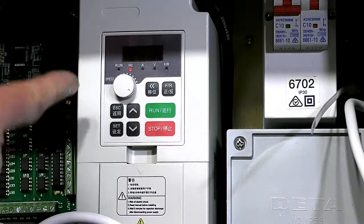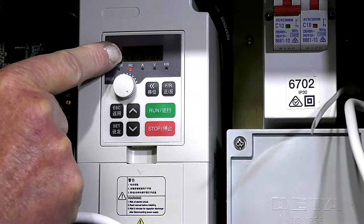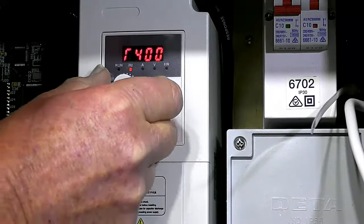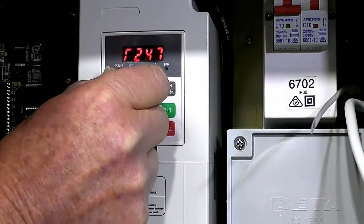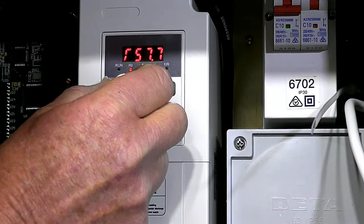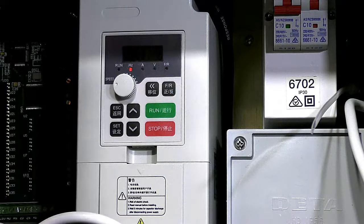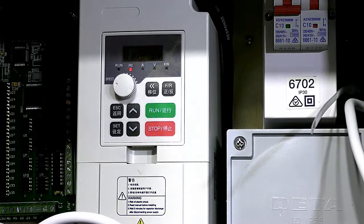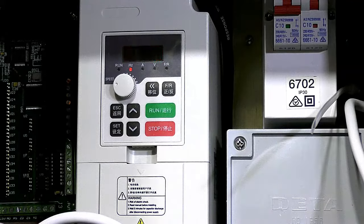In registry 9 you'll notice the outward-going Hertz is set on maximum. If you leave it too long it will go all the way back to the beginning. So I'm going to turn the output frequency right down to about 50 Hz, which is about 3,000 RPM, because this is an air-cooled unit. If I accidentally turn the motor on I want it to be turning at a reasonable speed so the fan is actually conducting some decent cooling.